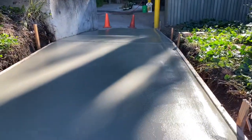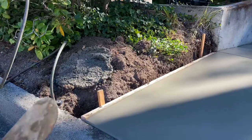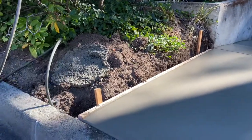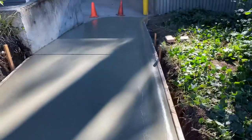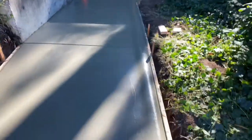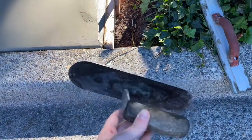It's going to all go downhill, but we added that hump after the fact. You want to have the driver leave you a good blob of concrete, and then I take shovel loads and lay it all the way down. Then use the mag to shape it, and this little guy works awesome for small detail work.